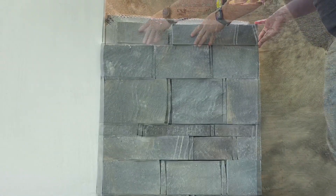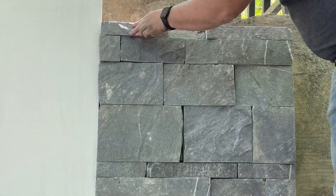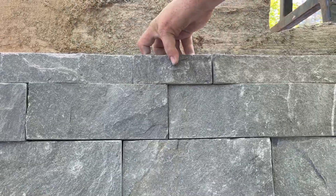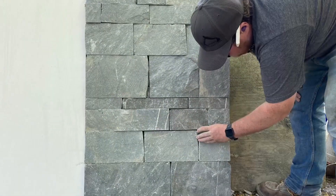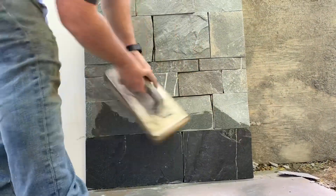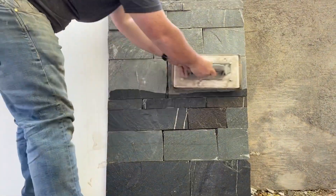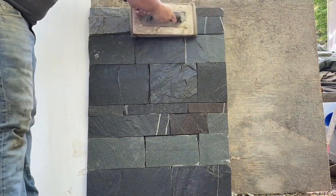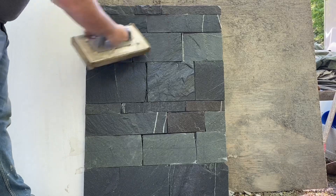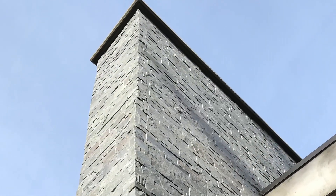All the way to the top. As you get up to the top row, you may have to rip the top row depending on what you're working up to — whether it's the ceiling or what have you. You just want to make sure all the pieces fit really nice, and any little gaps at this point — finishing touches — get filled in. You could really take the time to cut it all nice and tight, whatever suits your preference. Give it a good clean, get rid of any dust residue. If the stone is a little dirty when you're laying it, you might want to consider sponging off the back of all the pieces too. And here's the nice finished texture and what you can accomplish on a grander scale.